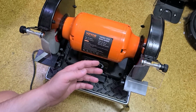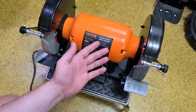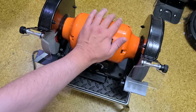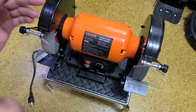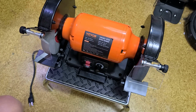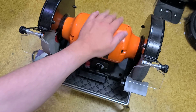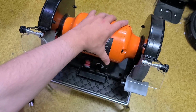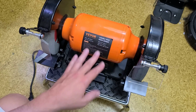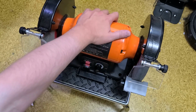So, in conclusion, I think with the free shipping, I was considering it, given the issues that you're going to have: going to the hardware store to get some 9/16 fender washers to get the wheels straight, and the fact that it's basically missing a light. Those ill-fated little double-mounted LED things are just the worst idea ever. Despite those issues, free shipping on something that probably weighs 25 pounds, a fairly large package for $150. It's easily competitive with one of the Harbor Freight 8-inch grinders.